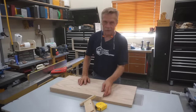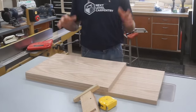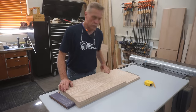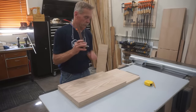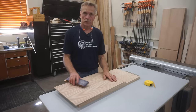And naturally, that's a bit monotonous too. But what I end up with is precisely sized bottom panels for these drawers to make sure that they come out perfectly square for going in the cabinets without trouble. And no surprise here, I've got slight roughness on the corners from the table saw, so I'll use 120 grit on a sanding block and give all the edges a quick wipe so that they don't dig in when I put them into drawers.